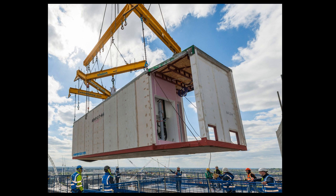In the factory, the structure of the module is assembled and squared. The concrete floor is poured with the walls in place and then the ceiling is fitted. Services are fitted — electrics and plumbing for bathrooms and kitchens and first-fixed ductwork. Internal walls are then fitted and boarded. Kitchens and bathrooms are fitted, including the tiling. Windows are installed and external insulation is fitted. Modules are decorated, cleaned and snagged.